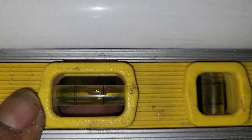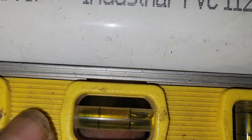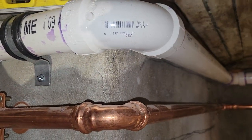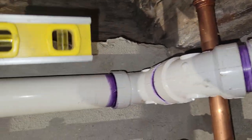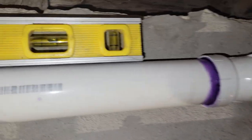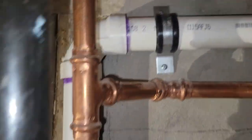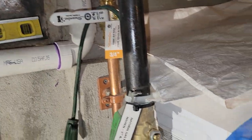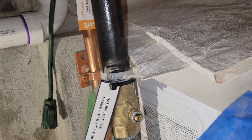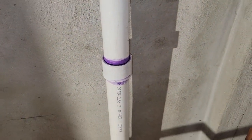That's still good — regardless, I did not create a trap. The pipe comes around and if you look here I'm starting to come downhill more, keeping my pitch downhill. Here I'm still going downhill, and here I hit an elbow and it definitely goes downhill.